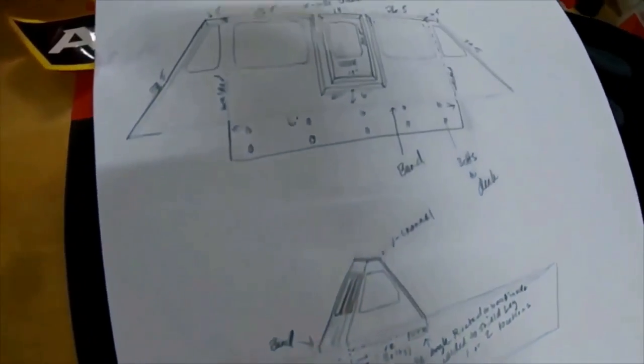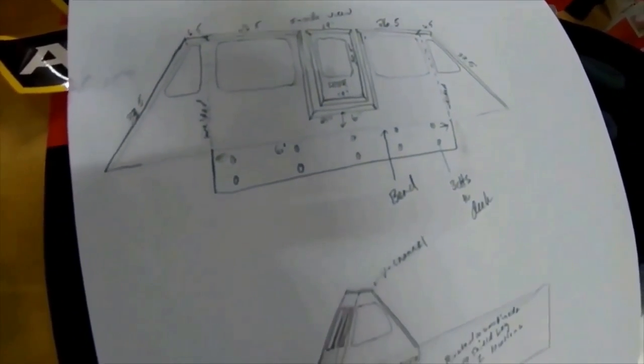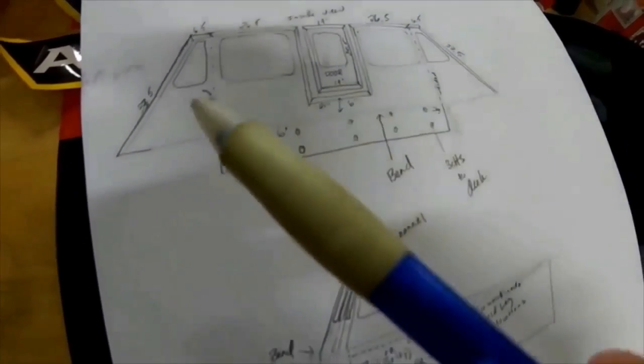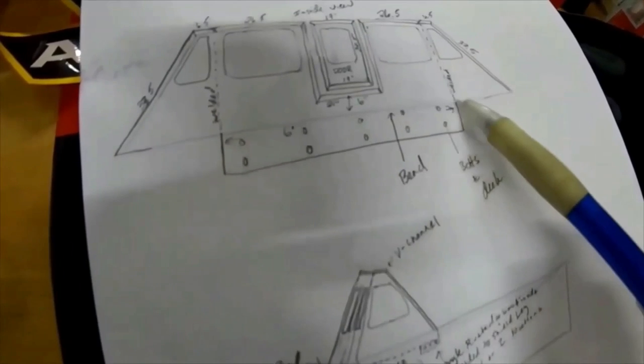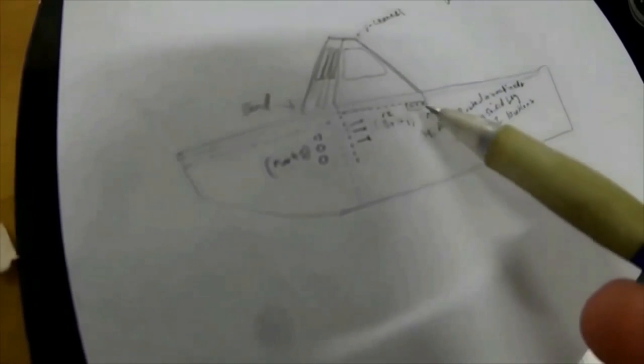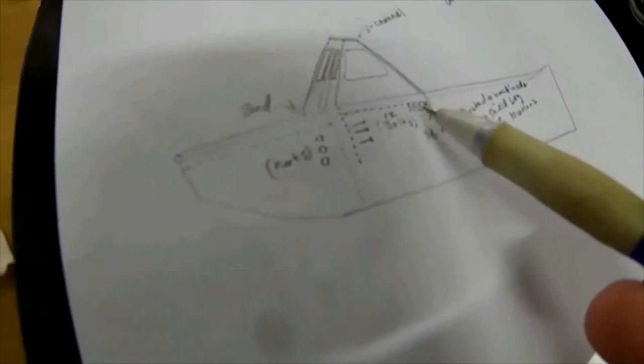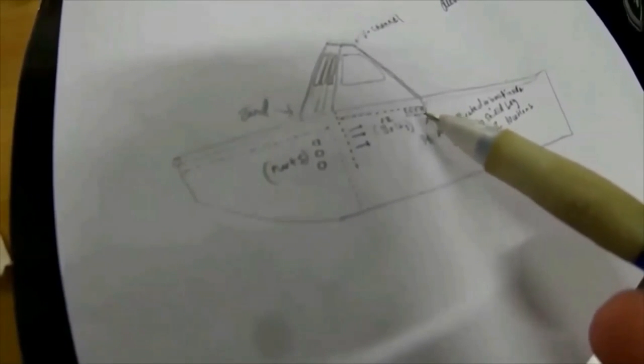There's a plan. Put a bend right here. That way I can bolt it to the bow back. And be pretty strong that way. And on the side leg, I'll rivet a piece of 1/8-inch angle to the side of the boat.